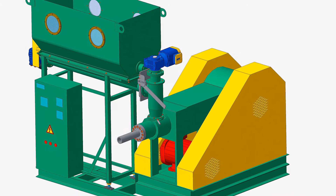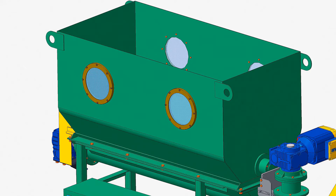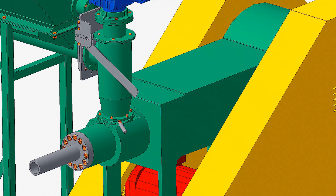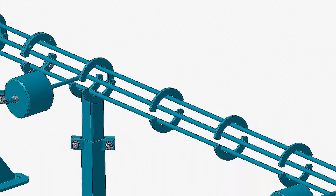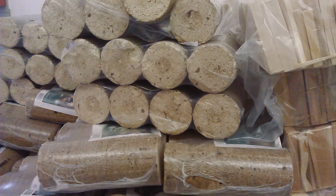Let's consider the specific example of mechanical pressing by the machine LB500. The raw material is fed into the hopper of the mechanical briquette press LB500. The screw feeder conveys the mixture into the pressing zone where the pressure and temperature increase. The feedstock is forced through a forming die where the material is compressed. As a result, briquettes are formed. Further, the briquettes are pushed through the cooling tray, at the end of which there is a cutting device which divides the briquettes to the desired length. The product is ready for packaging.